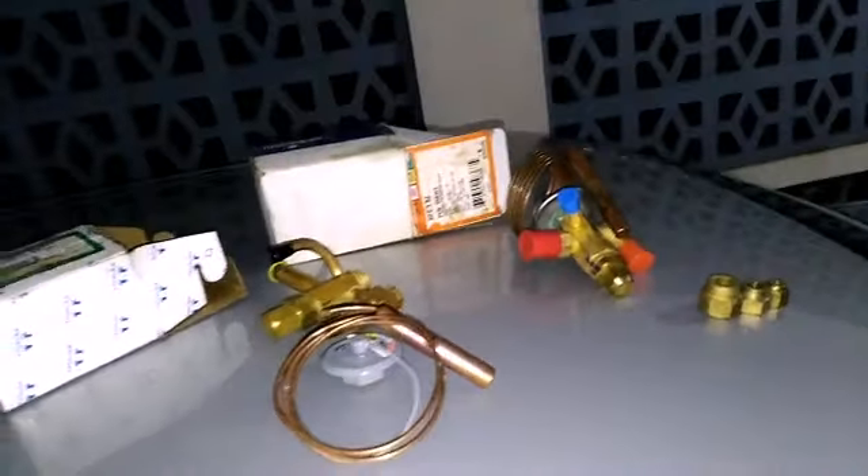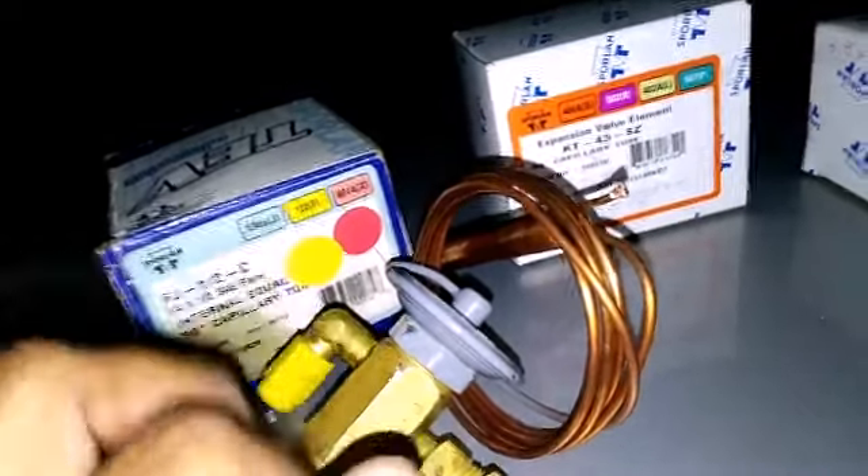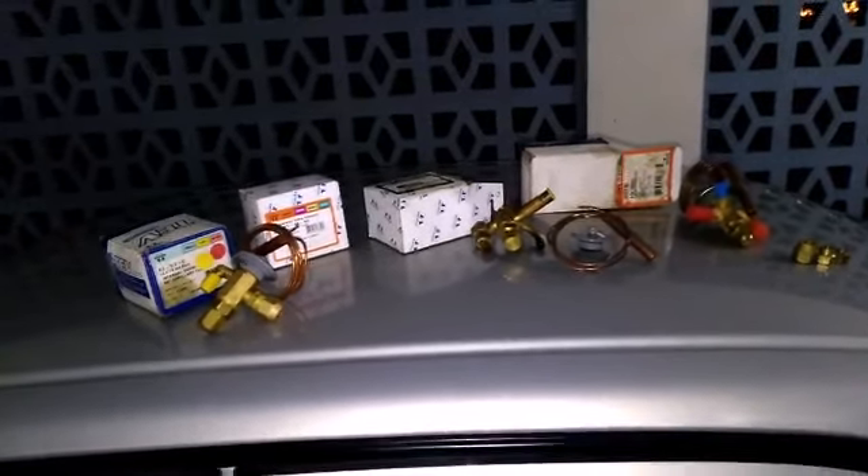So that's a short video. There are Sporlan bulletins — you can check them out online; I don't know the number by memory, but they have one for expansion valves. For this BQE solder valve, they have a sheet that tells you the orifice sizes, capacities, and power heads. That's TXV 101 — just to show you that these Sporlan valves have interchangeable power heads and you can build it to any capacity depending on refrigerant, orifice, and cartridge. This is a C charge, good for R134A, R12, or MP39. That's it folks — thanks for watching, like and subscribe, and leave any questions in the comments.